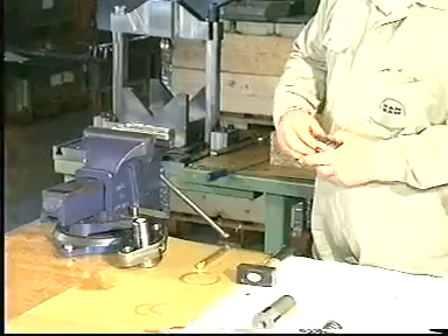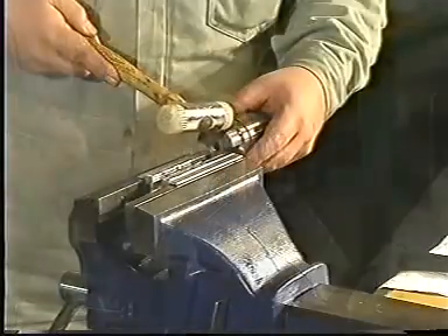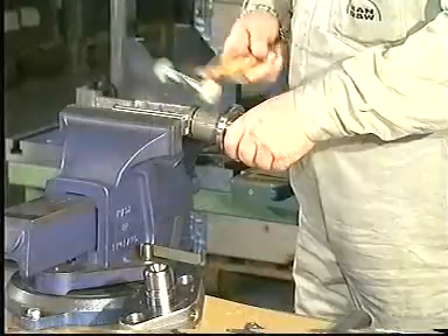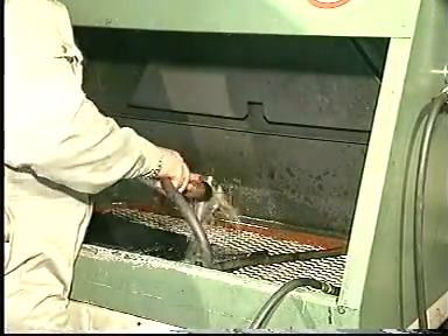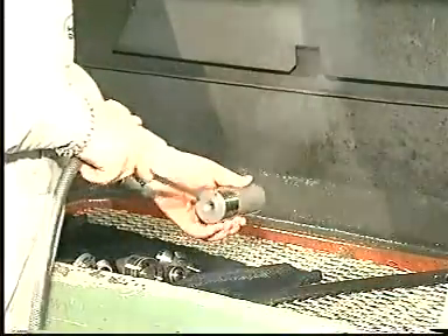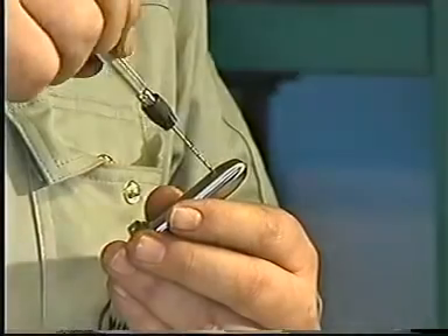Remove the sealing ring from the spindle guide. Disassemble the spindle guide with a brass mandrel and a hammer. Disassemble the non-return valve using the special tool. After grinding and milling, clean the parts in gas oil and blow clean with compressed air. Use the special drills to clean off any carbon deposits in the central bore of the fuel valve nozzle or in the spray holes.